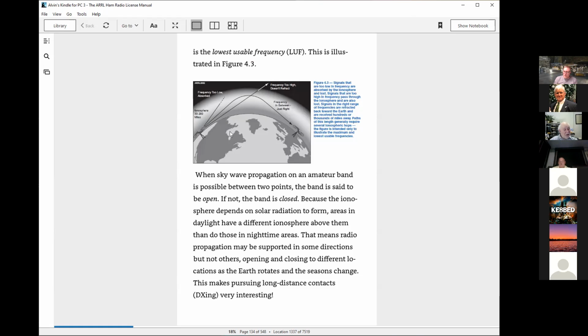Actually, the 2-meter band is closed, 6-meter band is closed mostly, 440 is closed mostly, and all these others, they're closed because they usually don't reflect off the ionosphere. But you can still get line of sight. So just your point of view, to an old HF guy like me, yeah, the band is closed, it's worthless. But no, if there are 4 or 5 guys in my area who are nearby and our antennas see each other, then we can have nice contacts with each other.